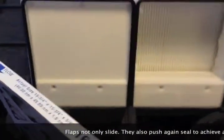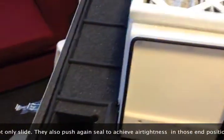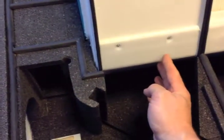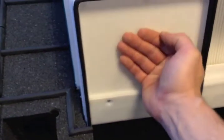I'm gonna explain in a little detail how we actually do the magic here. You have an inlet — this is the airflow from the outside. It goes through this channel, through the filter. Because the channel is this big in reality, it goes and it's divided by this tip in the middle. It cannot go anywhere here — it is forced to go into the upper part, then down, and it goes through this area of the heat exchanger. It enters the entire surface of the heat exchanger right over here.